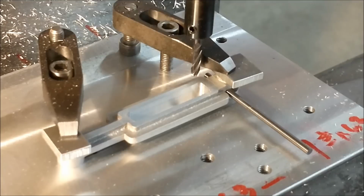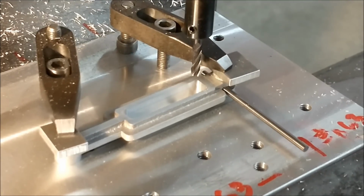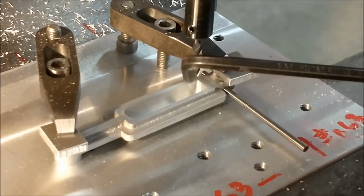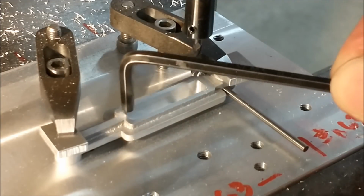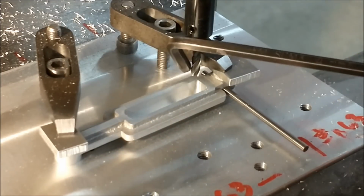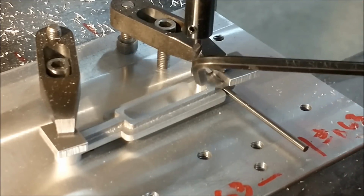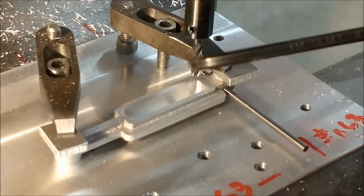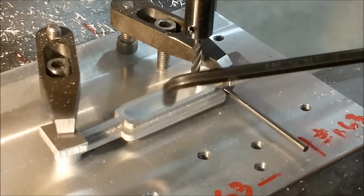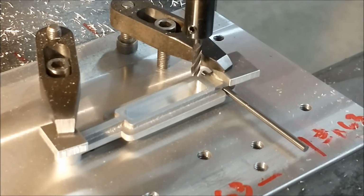I'm going to drive the dials in a clockwise direction, okay, clockwise. And I'm going to come back to my finished wall distance. When I take this cutter and I traverse, plunge it, and then traverse this back face, the next move will be a clockwise move. So the dial is clockwise loaded here to this corner, clockwise loaded again to this face, and then counterclockwise. So if you have to worry about backlash, when you plunge this, go halfway across. And when you come back around, connect the dots. Let's see if that works.